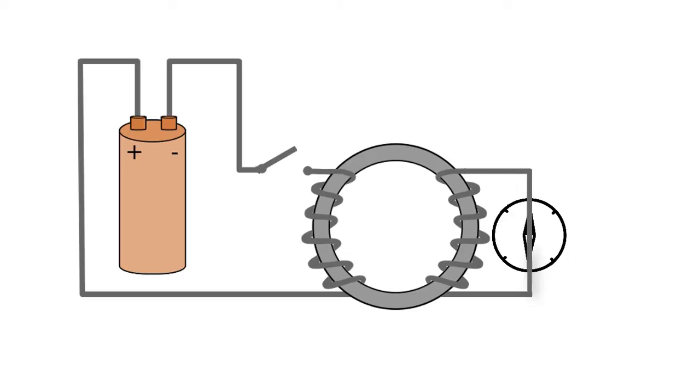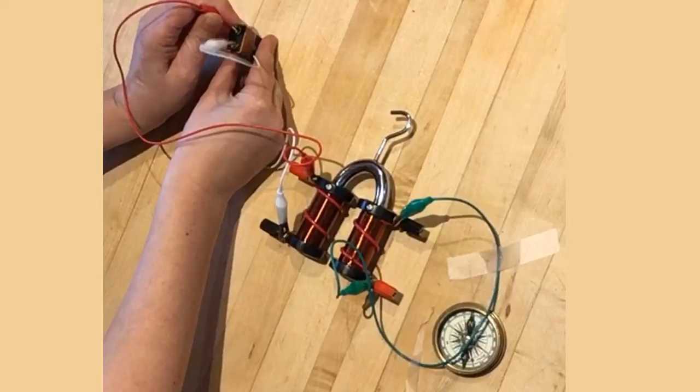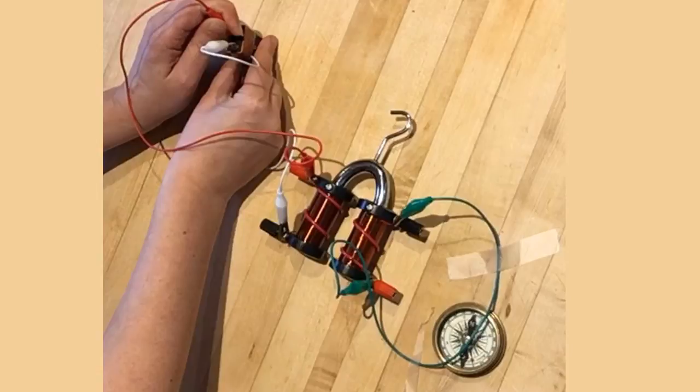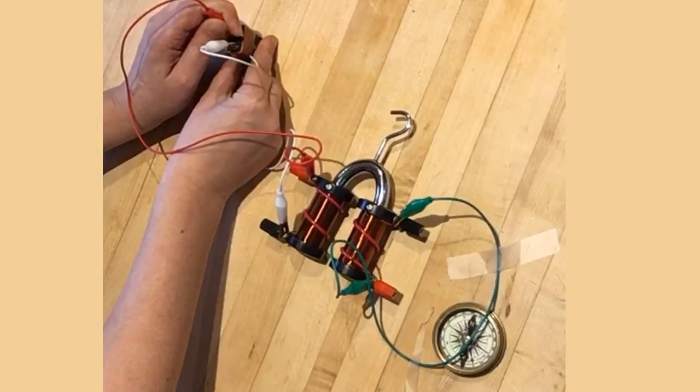When Faraday connected a battery to the first coil, an amazing thing happened. The magnet next to the second coil twitched, then nothing. When he cut off the current, the magnet twitched again in the other direction, then nothing again. Faraday repeated this experiment many times, and he found he created current in the second coil when the first one was charging up or discharging, but never when it was flowing steadily, even when it had incredibly large current. In other words, an electromagnet only creates current in another coil when the magnetic field was changing. If its strength is steady, nothing happens.